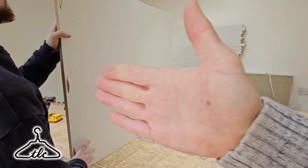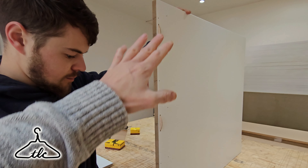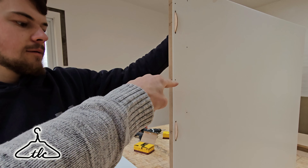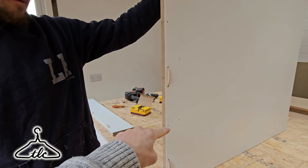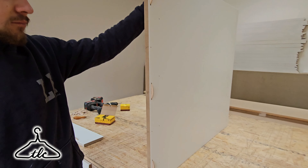I always find the best way of designing these is SketchUp. If I click on the Orbit tool, you can move it around. Going over the design once more — we have got this post here, representing the new post. There's only 36 mil step back there. So we've gone for 25 mil trims with 18 mil fascias, so we've got enough distance for the trims to fit in and wrap round and down.